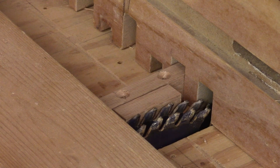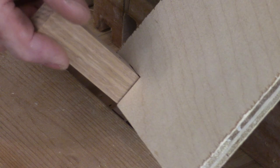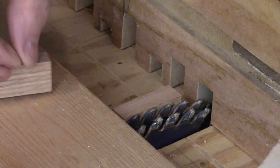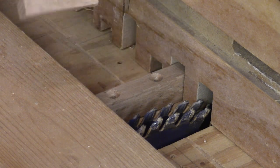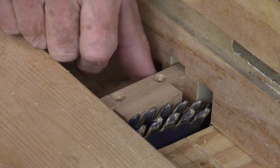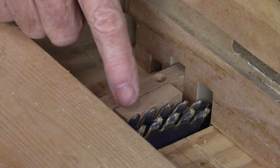While the glue-up is drying, I'm setting up our dado set — we're going to put box joints in this thing. This is a spacer; it fits right in there and has to fit perfect. I've got this other spacer here so that this spacer is exactly parallel with the blade.